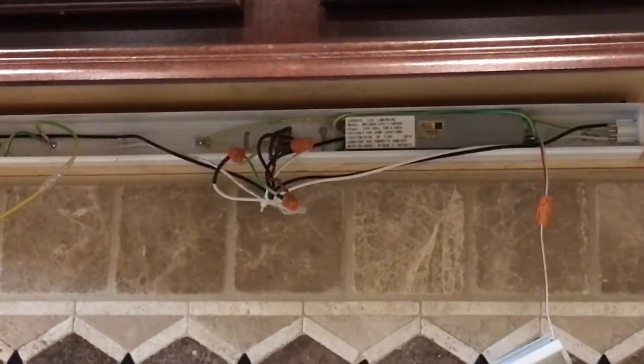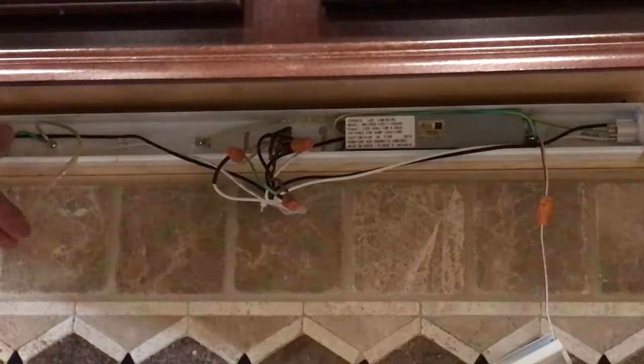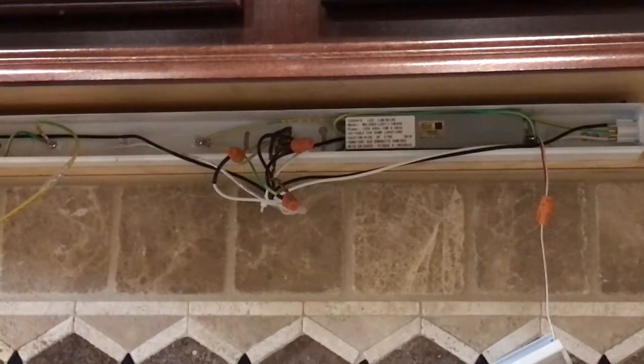We're gonna put that mess inside the box there. We're gonna reattach the green wire, the ground hanging down right here, with a little screw. Little screw we got right there. And we're gonna just pop that cover back on. I don't know, maybe 10 minutes to install. Again, it was already pre-wired, which made it a lot easier. Like I was saying, if you are gonna build new cabinets, like these are still pretty good shape. These are Kenmore, they're pretty nice. But if you're gonna do new cabinets, go ahead and pre-wire everything or have your electrician pre-wire everything.